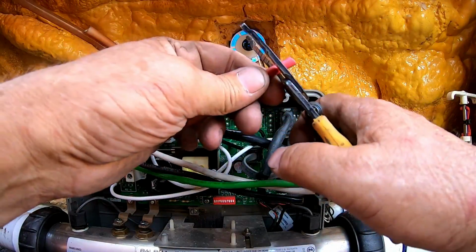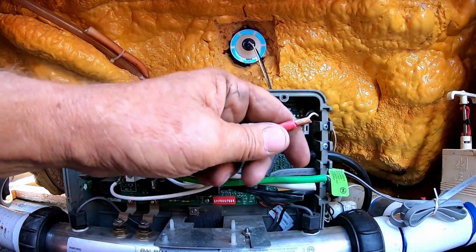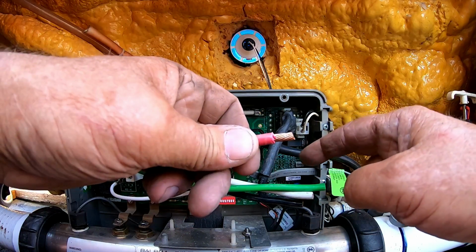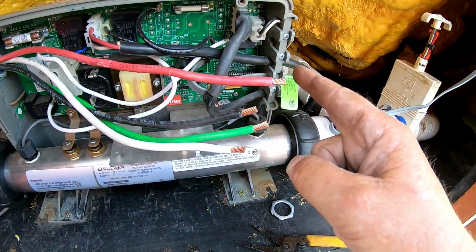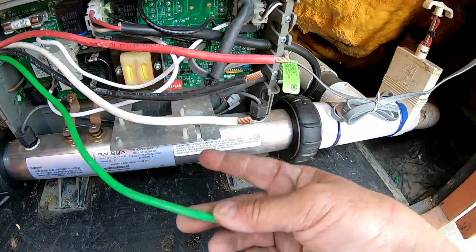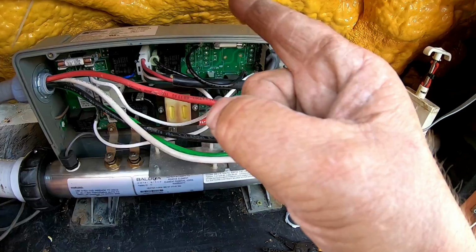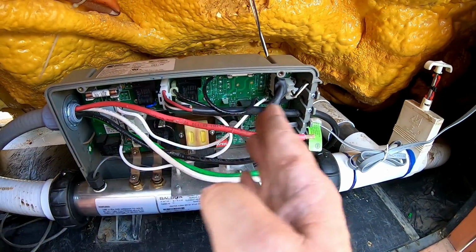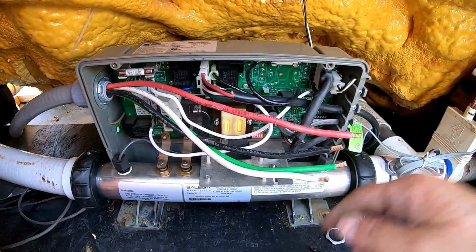Well, today I forgot to bring the right size wire cutters, but these still work. And that's all you want to do is strip back approximately, I want to say 3/8 to about 1/2 inch. And you do that on all 4 wires. Okay, I've got the hot wire, the ground, and the white all stripped. Now all these are number 6 wire. I'm running from the sub panel to the hot tub, number 6, because this system requires a 50 amp GFCI wiring system.